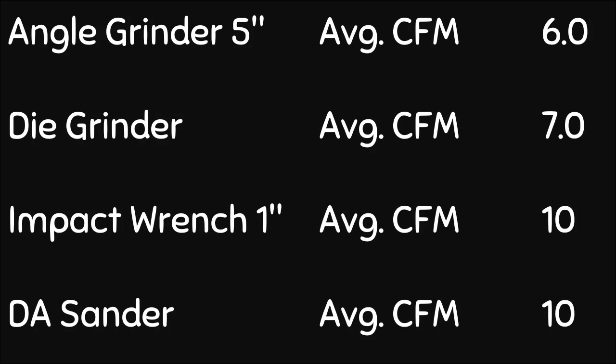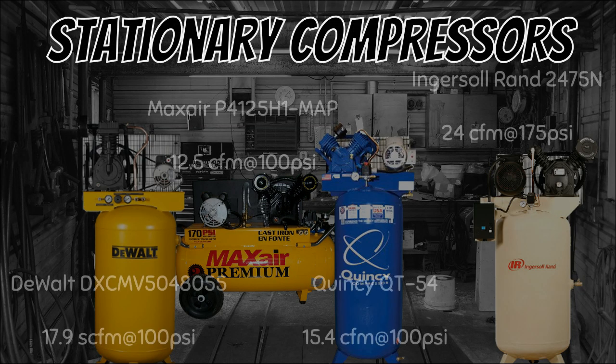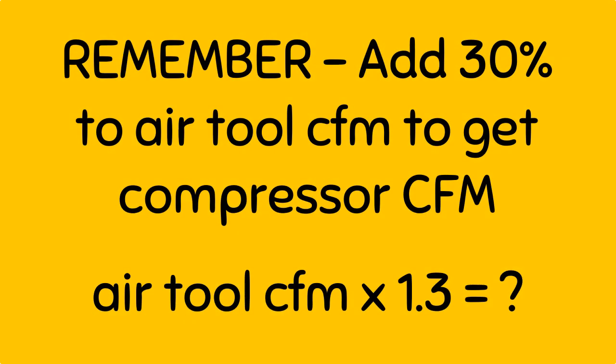The air tools shown here are air hungry. 3 of the tools are often used for a full minute or more, so the average CFM here can be misleading. You'll notice that on these compressors their rated CFM is measured at 100 psi or more. Remember, add 30% to air tool CFM to get the required compressor CFM.